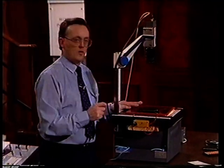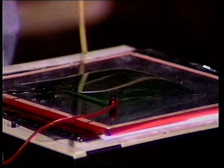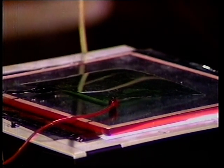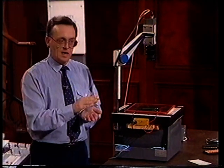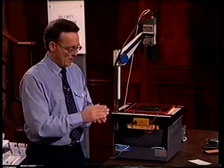I have a simple experiment here to show that to you. I have two pieces of polaroid, and in between I have a liquid crystal cell. I've put a special pattern on that — a certain electrode. What I'm going to do now is to apply a small voltage, only about one and a half volts. And what we should see is that plane of polarization changing, and you should be able to see an interesting character. There he is — an old Welsh sheepdog.